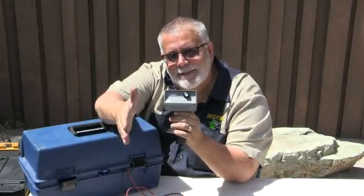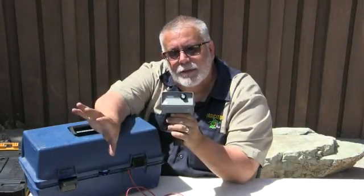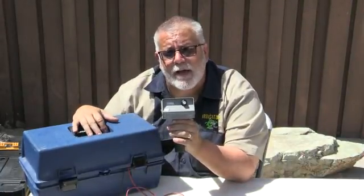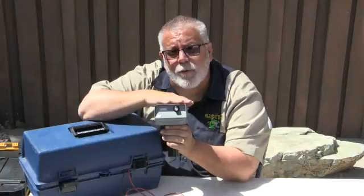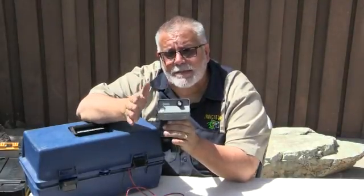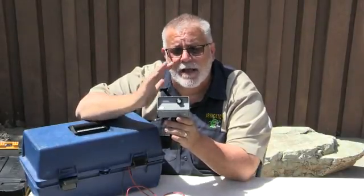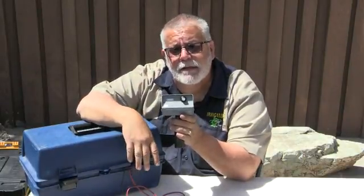It's a very slow process — not something you can just run through. If I have the signal too high, set to five, which a lot of people do — they think, why take two aspirin when you can take ten? — that's not how it works. You put it on the lowest setting so it bounces back and forth. If I put it on the highest setting, I am going to pass up nicks. Any little shovel nicks or root nicks, I'm not going to catch. You can have multiple nicks in the field, not just a solid break from a shovel.